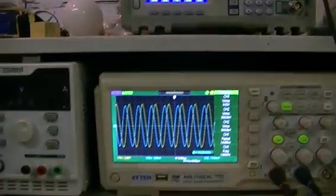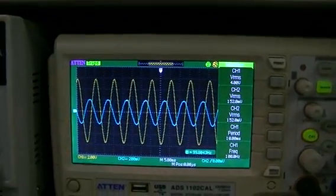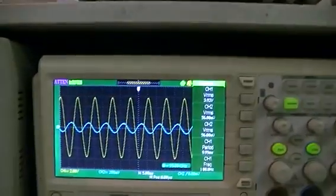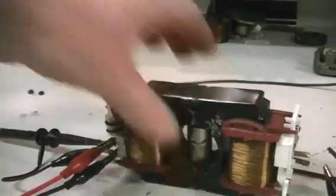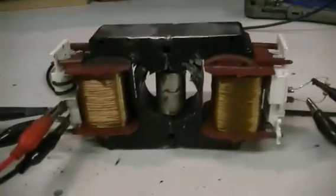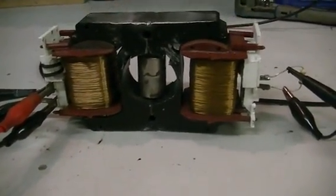Extremely interesting that that magnet — that I can't get out — it's open on the side like that, it's killed it. For some reason, this is very hard to do one-handed. So our magnet's no longer there. We have 56 millivolts RMS across our 100 ohm resistor. We'll put our magnet back in there, like so. And now we have 376 millivolts RMS across our 100 ohm resistor. Interesting. I'll let you know where we end up with this one. Let me know your thoughts, guys.